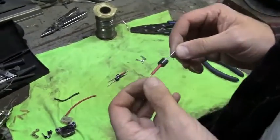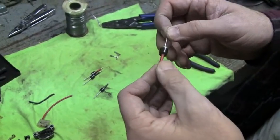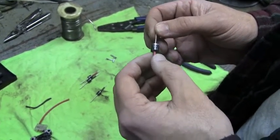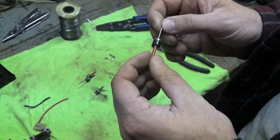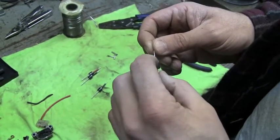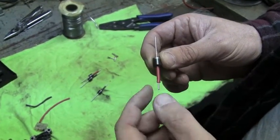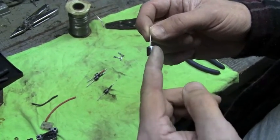So this is a diode. Diodes have been known as valves — I call them little gates. This is a 6 amp diode. Now our AC charging system is rated at 3 amps, but we believe in overkill since the last ones did go up in smoke. The way these work is they have a band on the top of them. Power only goes one way — it will only flow through the band. If power tries to come back the other way, it will stop.